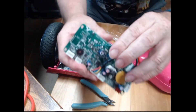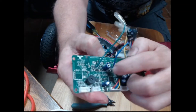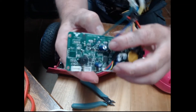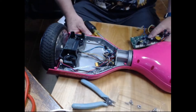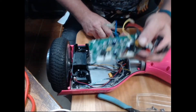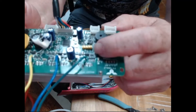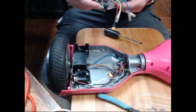What I need to do here is add a header — not at the microcontroller, but at the remote, which is the second one across. So I'm going to take this over to my bench and just put a four-pin header on there. Now you can see the yellow header in here — it's just four pins, and that's going to be where I mount the Bluetooth module once it's all back in again. So now I just put it all back in reverse order.